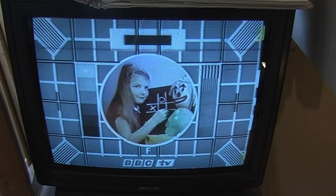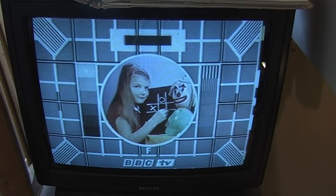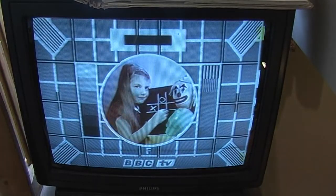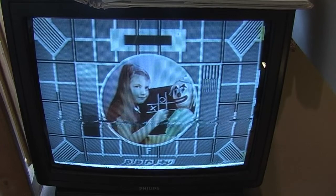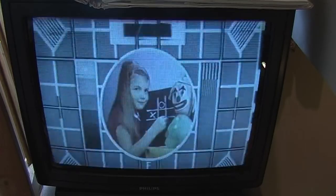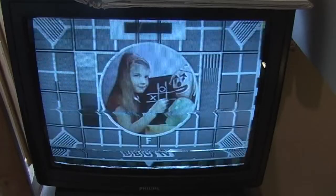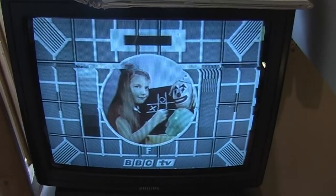See that picture sort of pulsating. That line that's going up, that black line, that's not really there, that's just a thing at the camera. That one coming down is, but. Oh, drum servo's a bit dodgy. That's just a damaged bit of tape, that.